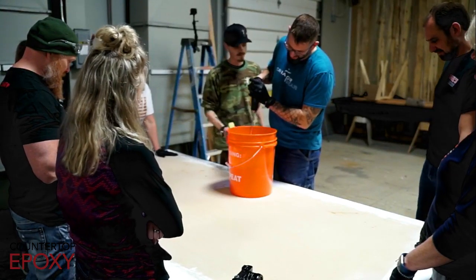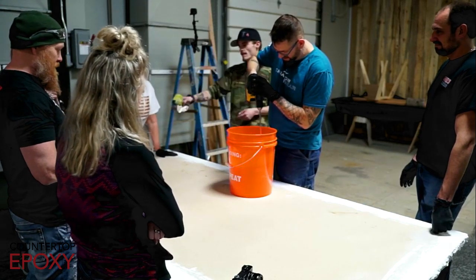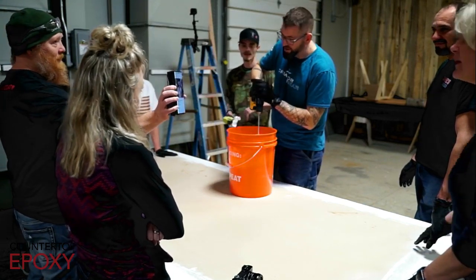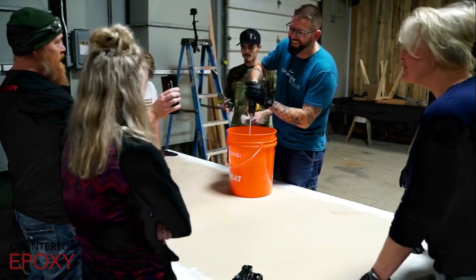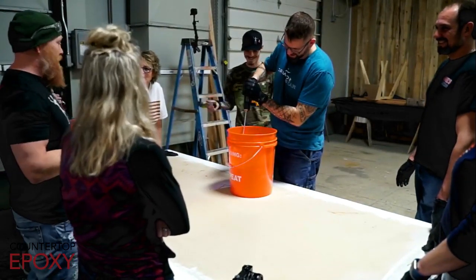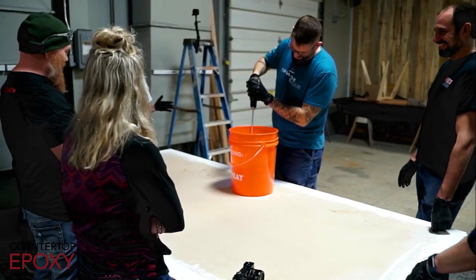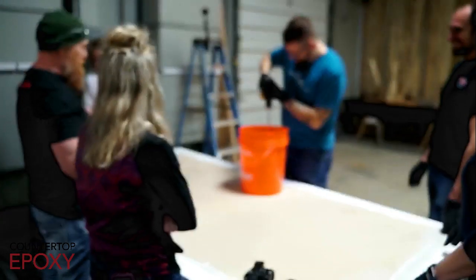We're just checking temp on that. 81 on the white, 81 on the charcoal, 92 on the... Perfect. So we're 92 on that silver, which is going to be for our wood grain, and 81 on our white and charcoal, which is going to be for our white marble. Who's excited about a white marble table? I'm pumped. With our chiseled edge on it.